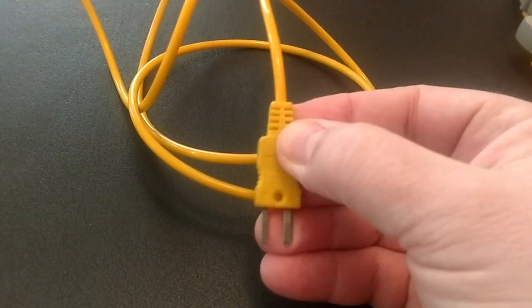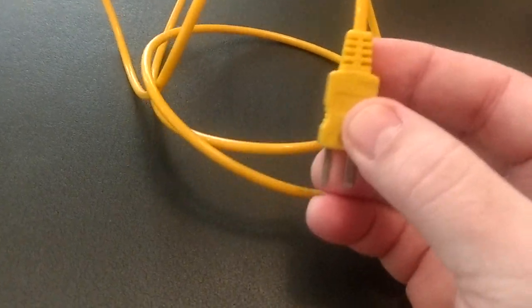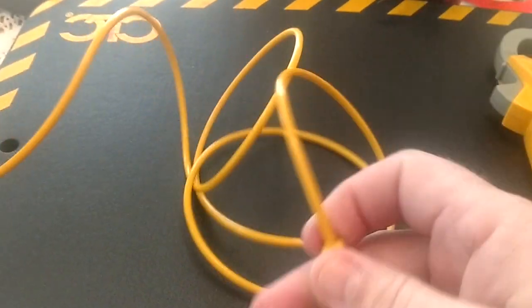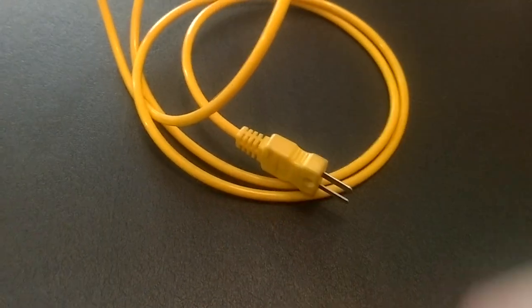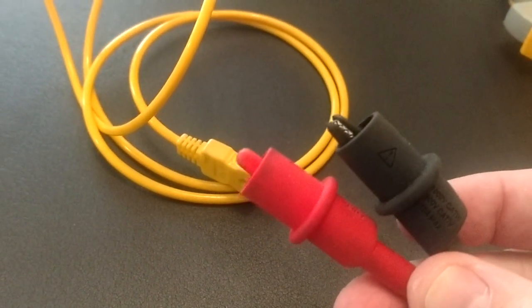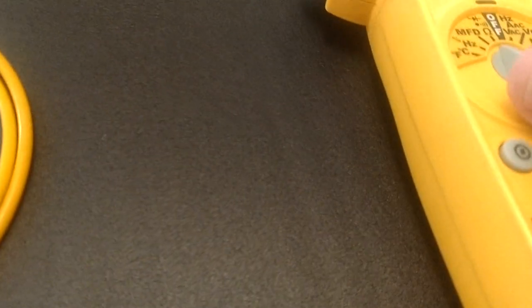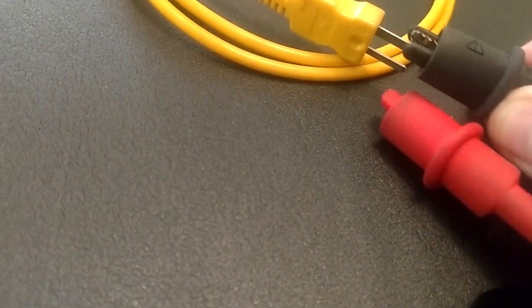Now here's another thing that we can do. Sometimes when we've got these things hooked up out there, we might be reading the temperature on our meter, and then all of a sudden it starts getting all wacky on us and flopping all over the place. Maybe you move this thing around a little bit and the temperature moves. So you're probably getting a short in this thing, more than likely. So what we want to do, we want to whip out our good old alligator clamps and our meter, and we're going to set this thing to ohms, and then we're just going to hook up to these little pins here,